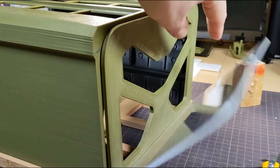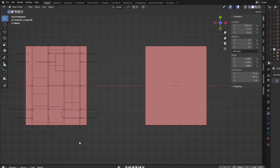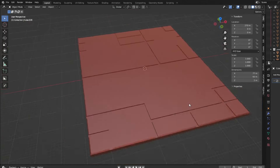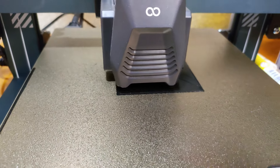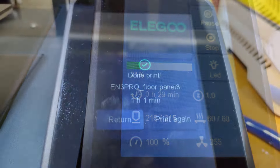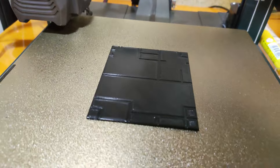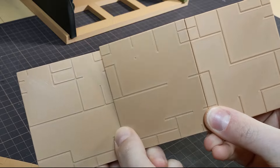Also, if you noticed, the floor doesn't exist yet. So back to Blender for 3 versions with lines that match end to end in any layout. Time for a race! I started the same panel on my X Plus 3 and my old Neptune 3 Pro, and these print times speak for themselves — the X Plus 3 is already done. The Neptune was still working on 21%. It finished in a little over twice the time, and in my experience the X Plus 3 is about 3 times faster for general printing in PLA.